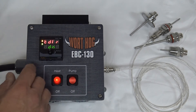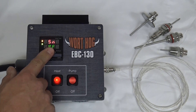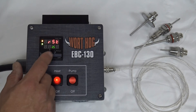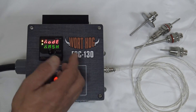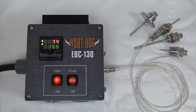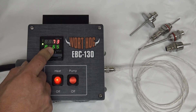This is the timer counting direction, currently set to down — you could change that to up. With the timer enabled, you'll see a new menu choice displayed when you push the knob: the timer reset. Before it displays mash or boil it's asking whether you want to reset the timer or not. You can hit the button again if you hit that by mistake. Turning the knob brings up the other choices: mash, boil, or reset the timer. The timer can be general purpose or it can be used to control mash and boil functions.